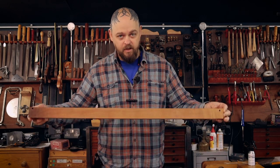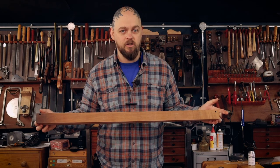Before I get to that though, this new neck blank needs to be roughly dimensioned down to its final size. It is six or seven days since I glued it up and it's settling, but I want to see if there is going to be any movement moving forward. I don't think so - it's multi-laminate, seven pieces plus veneers - but you never know. So I'm going to take this big chunk and make it slightly less chunky.